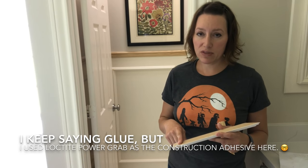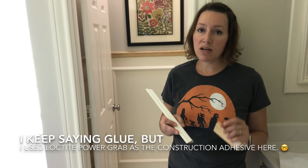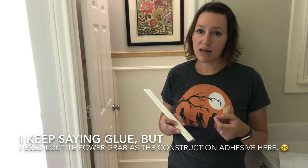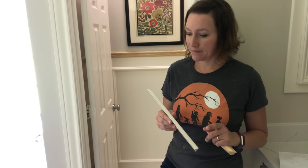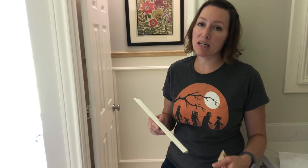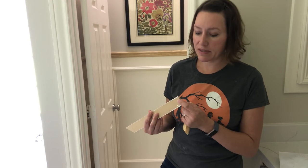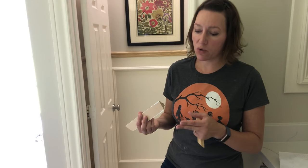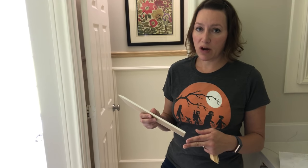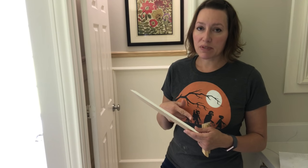I use a little bit of glue for these projects and my brad nailer to put it on the wall. Now make sure when you're using your brad nailer, especially in a room with plumbing, that your nails aren't going to go through the drywall. If you're using glue, all that nail really needs to do is hold the molding tight to the wall long enough for the glue to dry. Just make sure the nails don't go through the drywall because you could have pipes back there or electricity — it's really not necessary. I held the nail up to the thickest part of the molding and made sure it was only sticking out about a quarter of an inch. If it's not holding tightly enough, just shoot it in at an angle — sometimes that helps get it in there a little bit tighter.